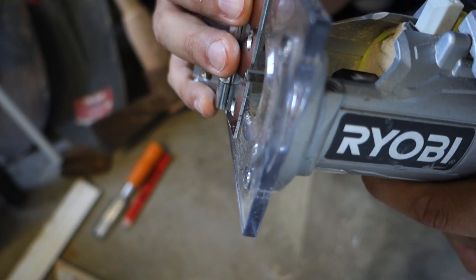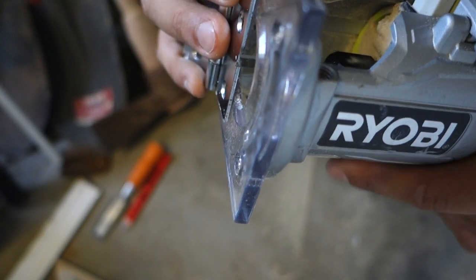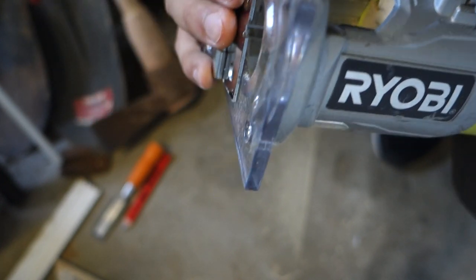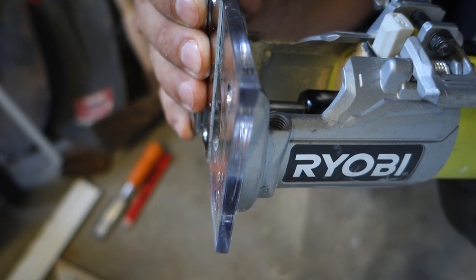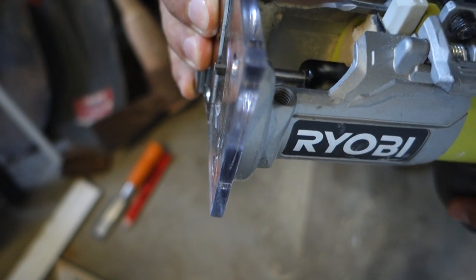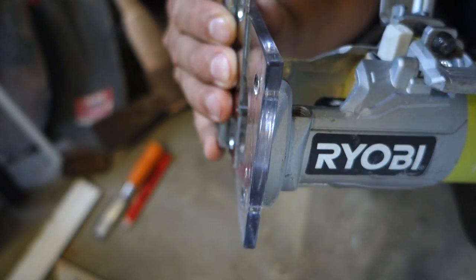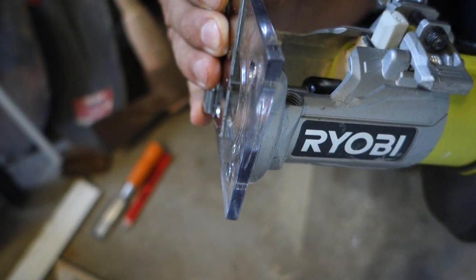So what we need to do is simply slide that up, get roughly the thickness of the hinge, which I've got just there. Then at the bottom we've got a little wheel here that'll allow for all the minor adjustments. So as soon as I've got the majority of it worked out, roughly how thick I need it, then I can play with my wheel down the bottom. And as you can see, I've just retracted it. I'll turn it back the other way and I can make it protrude once again. So I just need to play with that. We've got pretty much spot on right there. That is the thickness that we're going to need in terms of the hinge. Hopefully you guys can see. It's probably about 2 to 3 mil. That's all I need to cut.